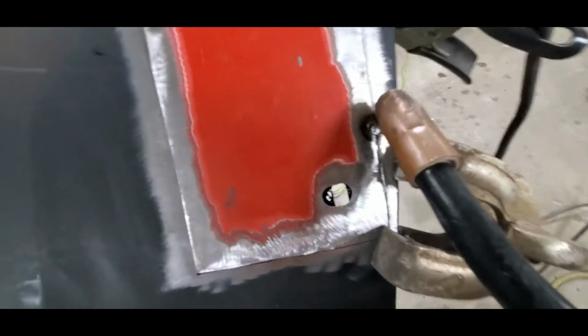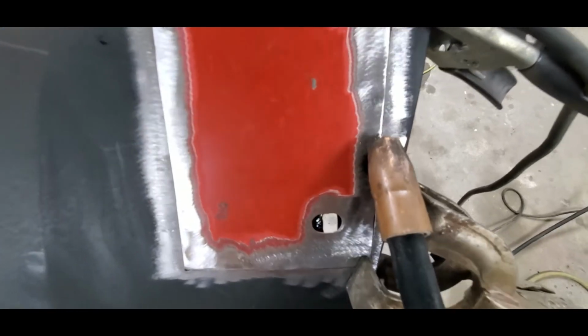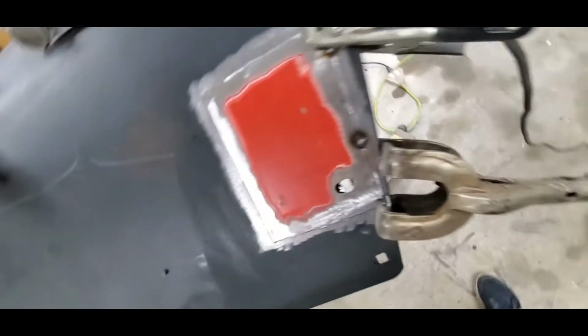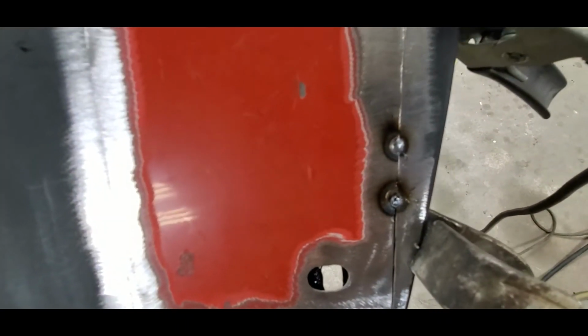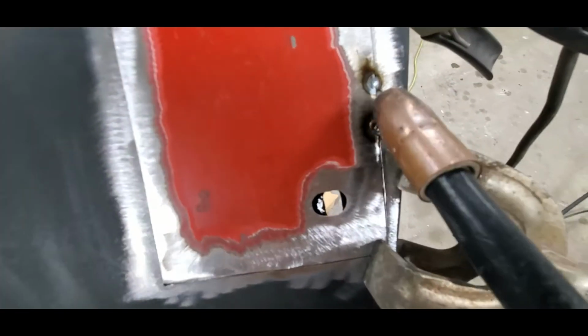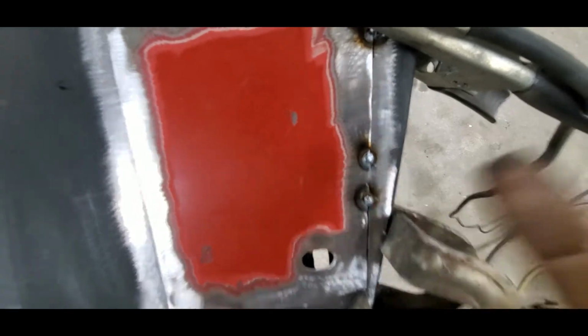And then take your welding wire right in the middle there, right in the center of that, I don't know if you can see it there, right in the center of that line, okay? Let me zoom out just a smidge. Right in the center of that line, nice little tack weld. That's all you need. It doesn't need to be crazy. The next one we'll do right below that, and we'll push it into the first one, okay?